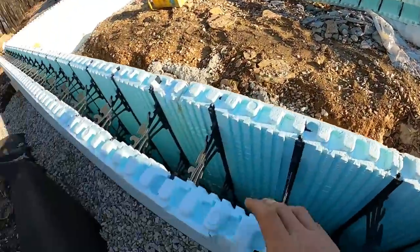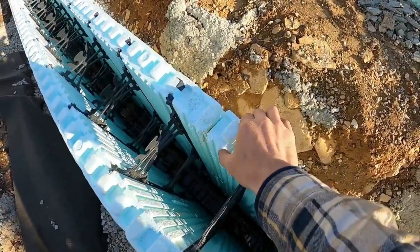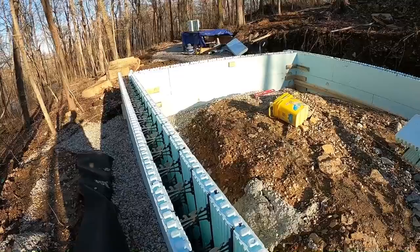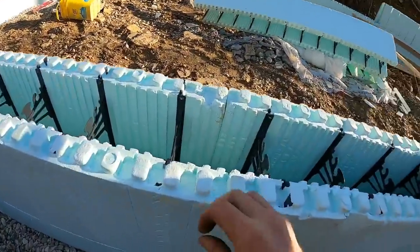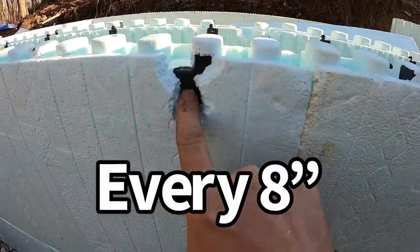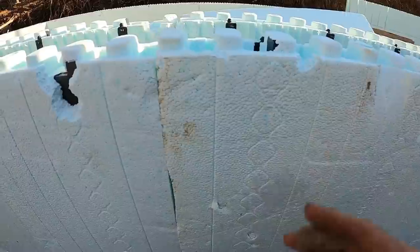Amazing curved wall, 2.5 inches of insulation, 6 inches of concrete, 2.5 inches of insulation, rebar on an 18 inch every horizontal, 18 inch vertical. You have an 18 inch rebar grid. That's pretty insane. That's not very common. All your studs are built in. Look, everywhere there's a diamond, there's a stud. Inside, well, that's the inside and outside. It's everything you need. It's amazing.